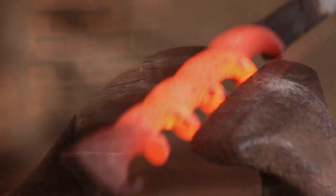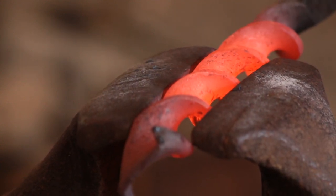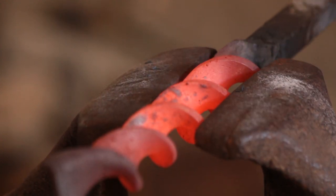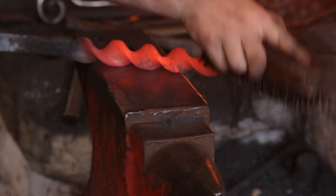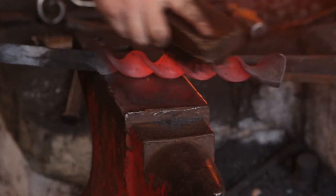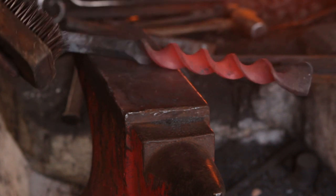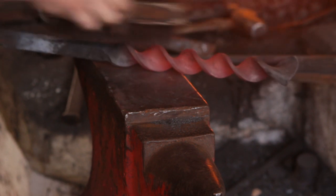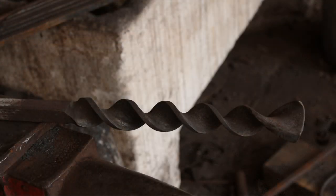With the twist done, I will use the vice to centralize and just straighten everything up — the vice is quite good for that; I'm not putting any pressure on it, I'm just literally squeezing everything straight. The final thing is to give it a good old scrub. Most of the forging marks will actually have been stretched out of existence, which is the nice thing about twists — it's a good way to clean up your work. So here it is: the blank auger with the eye, the body, and the screw all forged up.